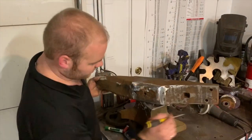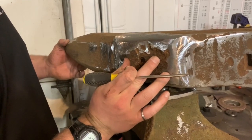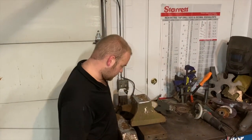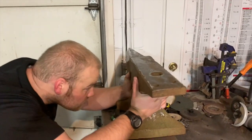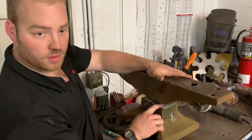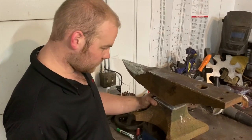You can see at the edge where I started beveling. With the stick weld I should be able to build up the bevel quite a ways, though it's not going to reach the center — I just need something to lock it into place. The base has also got a pretty good taper bevel at the edge. I think that's where we're going to leave it tonight. You can see how the two pieces fit — they kind of lock in place when you get it just so. I feel pretty confident getting it back in its old home. I'll put it on the press, get all the pressure down, then go in with the stick welder and prep the weld area real well before any MIG welding, so there are no imperfections. I've got 250 amps to work with, so I think we should have a pretty good shot at this.